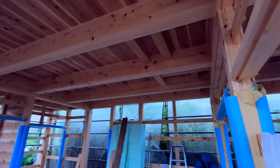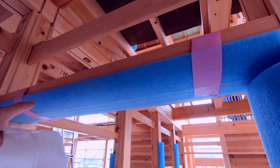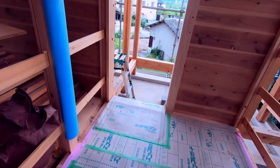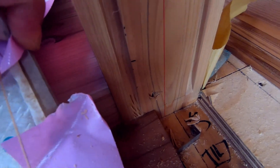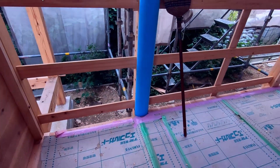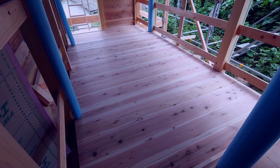Since the raising, a lot of the work we've been doing is on the floor and on these sills for the windows and doors. So this is the kamoi. And this is a window, so this is actually magusa. This is madodai — so this is the sill and that's the groove where the window slides in. The door is a similar situation where you have a grooved top piece called a kamoi and then a shiki at the bottom. And then under here — covered up with this protective piece — this is called a kamachi, which is like a step up. This is sort of the entryway room and storage space for the bread shop.